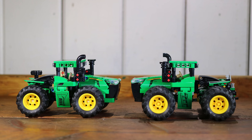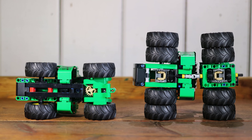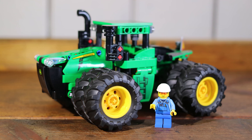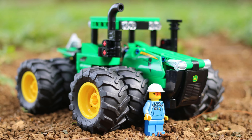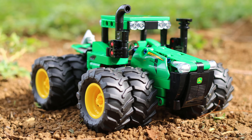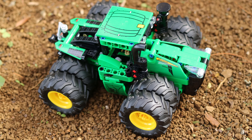As a side note, there are many reasons why tractors have multiple tire setups like duals or triples. The increased surface area of the additional tires helps to spread the weight across a larger area and reduce soil compaction — similar to why flotation tires are available for tractors. Another reason to install duals or triples is that the increased surface area also increases the efficiency to transmit torque from the drivetrain to the soil, which leads to more traction. The last reason is to help reduce or eliminate power hop — when the tractor hops, bounces, or jumps during field operation. Power hop is uncomfortable for the operator and leads to a loss of traction and efficiency.